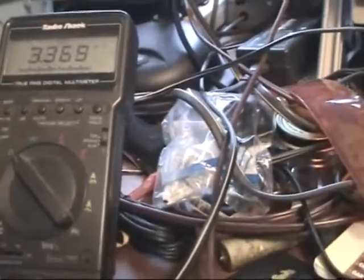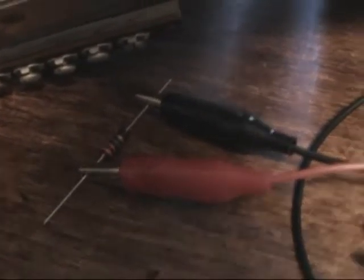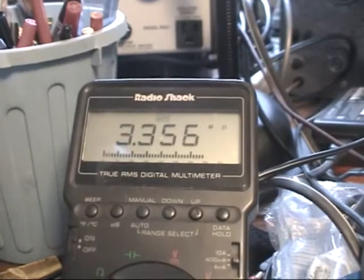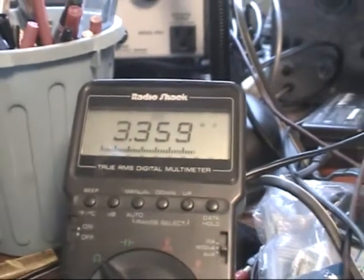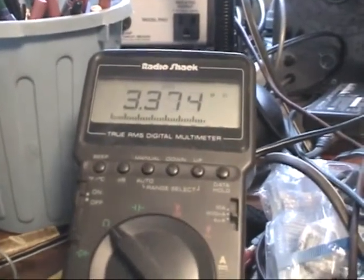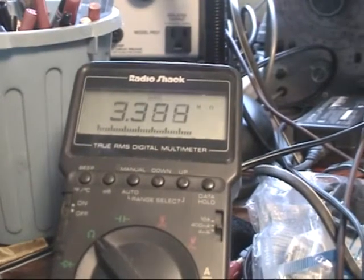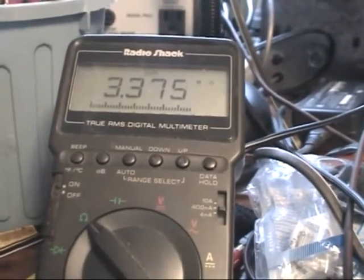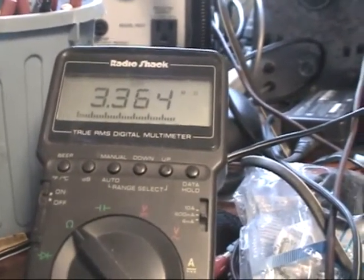I lift this side up. I've already got my meter hooked up and running — I've just got to clip on the leads. By the way, I've already got the leads clipped on a new replacement 3.3 megohm. As you can see, it's pretty close to 3.3 megohm. It can be 20% out of tolerance — that would be 300k plus or minus times 2, so 600k, meaning it could be as high as 3.9 megohm.